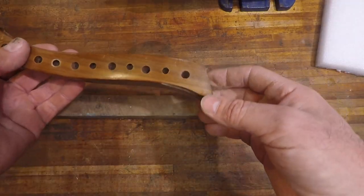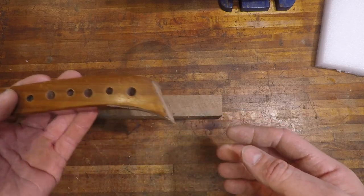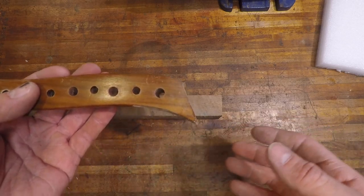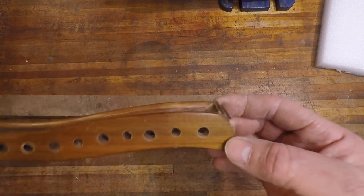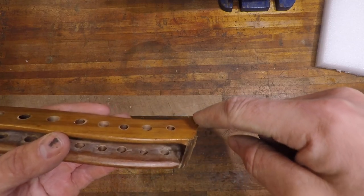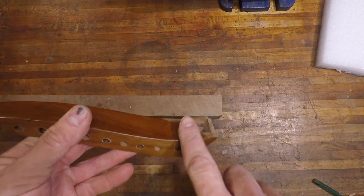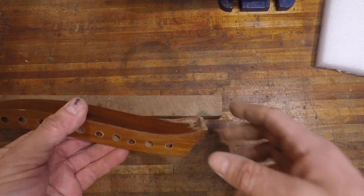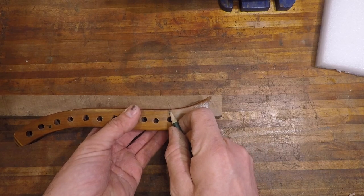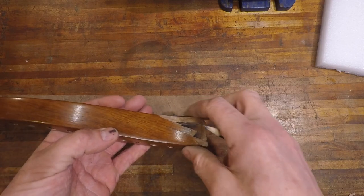Okay, so what I'm going to try and do here is make a repair that will be slightly noticeable if you look for it. But what I want to do is add a lot more strength than there was there in the first place. So, you know, the two glue joints you're relying on are these two right here. This piece right here and this piece right here. And this little veneer that comes along the backside over here. So my thought process is to essentially just lop this all off over here and make that a solid piece